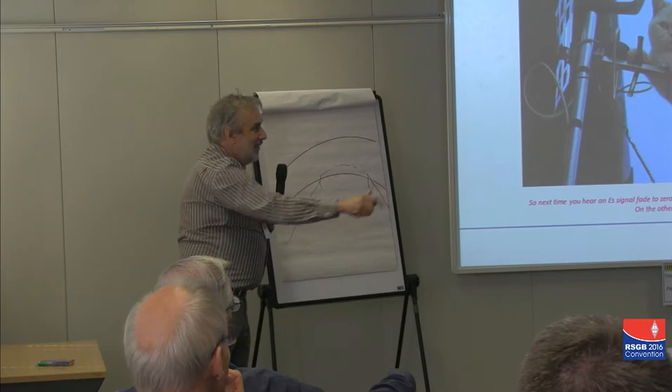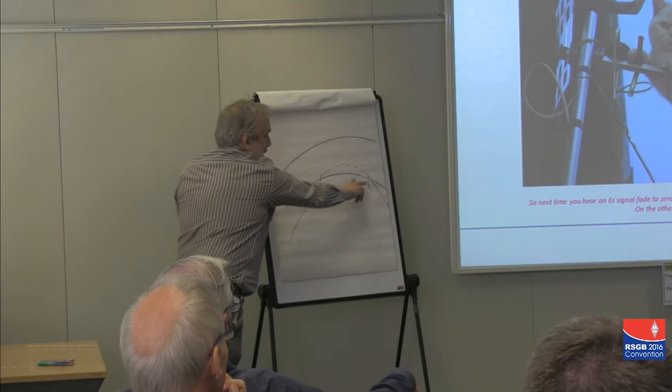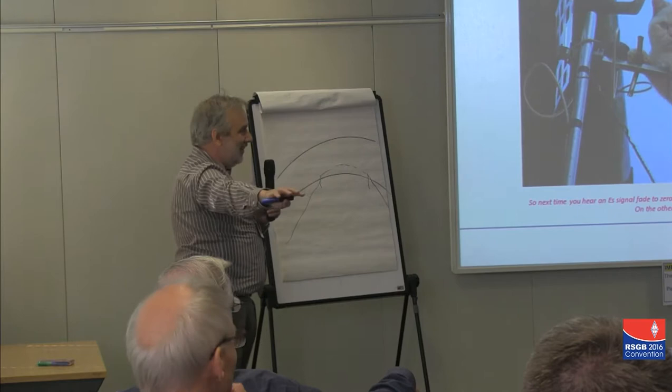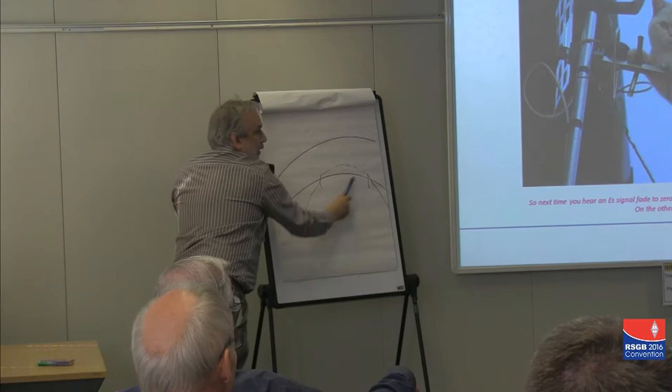And actually, terrestrial propagation has got the same problem, I believe. And of course, where you have two hops, you've got that combined twice, so you've got the variability twice. Absolutely. And when you get to six hops, you've got chaos theory coming in. So actually, whether it's elliptical or whatever, depends on the path length there, the electron density, and the direction of the two components with the magnetic field.